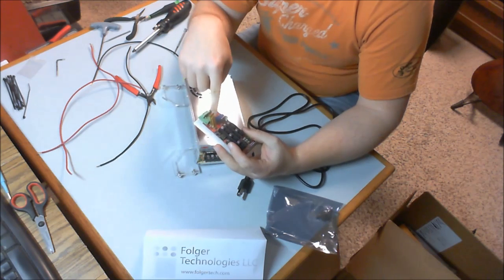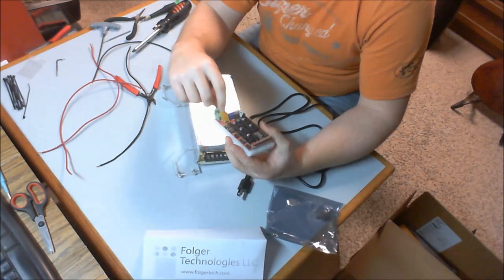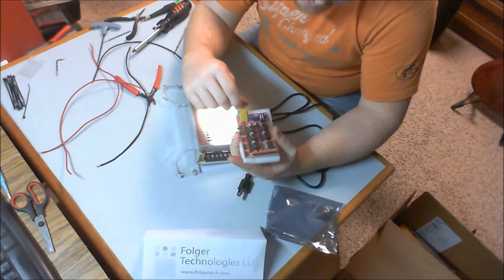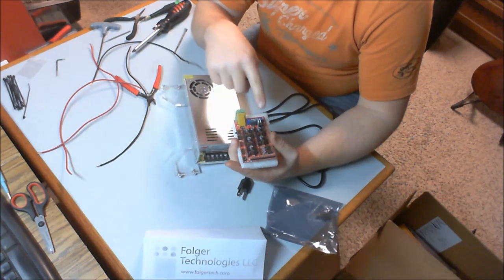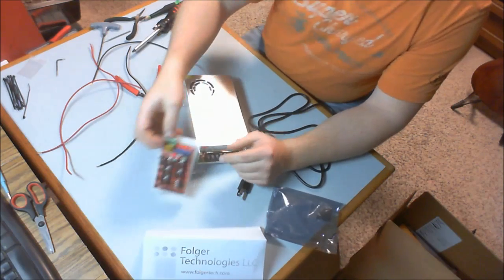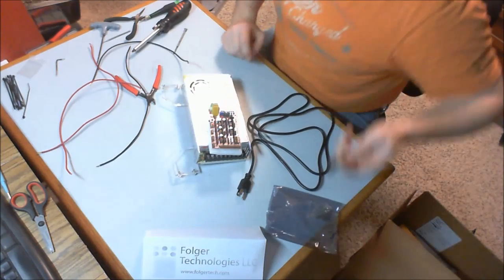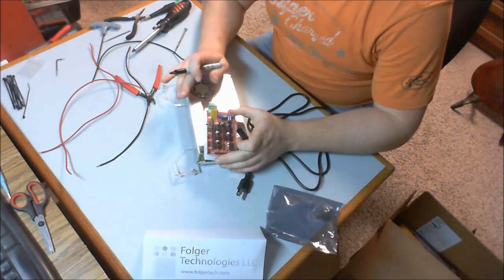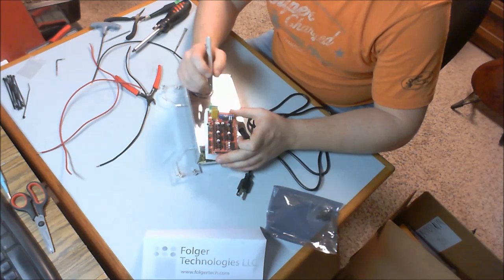Now if you look really close on the ramps board, kind of underneath these yellow, I believe these are resistors, pretty positive. If you look underneath there, you will see screen printed on the circuit board, a plus, a minus, a plus, a minus. So what I'm going to do, just to make my life easier to remember, so pluses I'm not going to mark anything, but on the minuses I'm going to take a Sharpie and mark a little black mark.